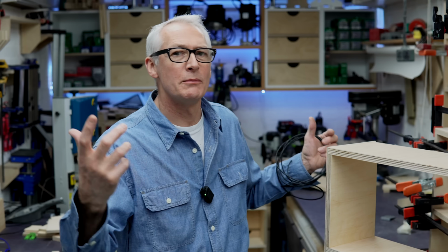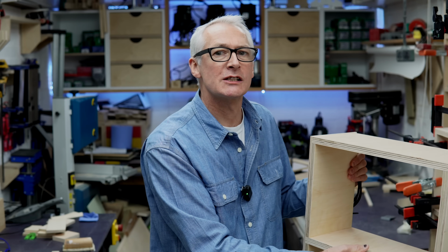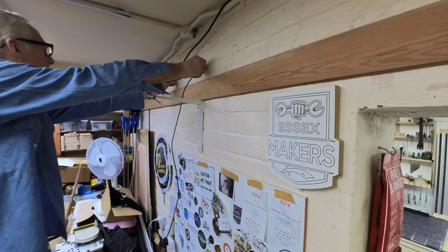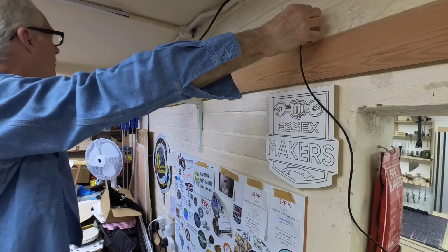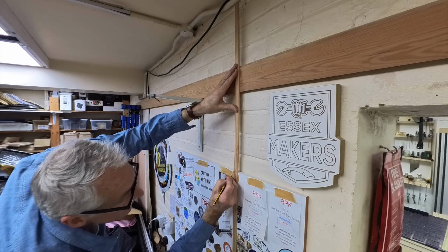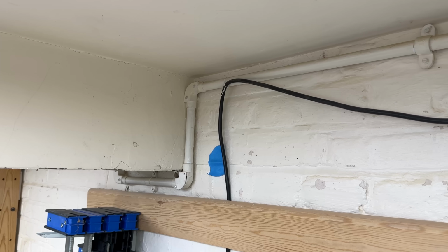I hope you're well. In this one I'm making some plywood wall cabinets for the workshop to try and contain some of the clutter in the room next door, and just for fun I'll be making them without a tape measure, a ruler or a square, and without nails, screws or any other kind of fixing. So instead of a tape measure I'll be taking overall dimensions of the space where they're fitted with a piece of cord, and I'll be using marks on a rod or story stick using relative measurements to size the final pieces. I'll just be gluing these pieces together to make these cabinets.